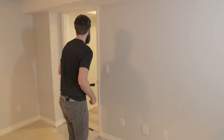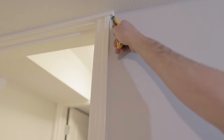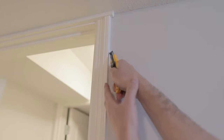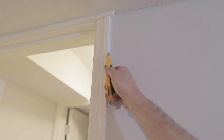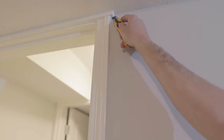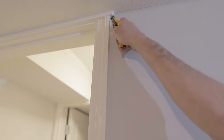The first thing you want to do is cut along the edge here with your knife. Just be careful — you can go back a few times. What you don't want to do is hold the knife too much upright because you'll be cutting into the drywall, and if you hold it too flat you're going to skate onto the molding. So you want to be about 45 degrees to the wall and the molding.